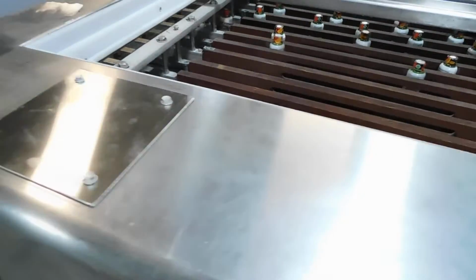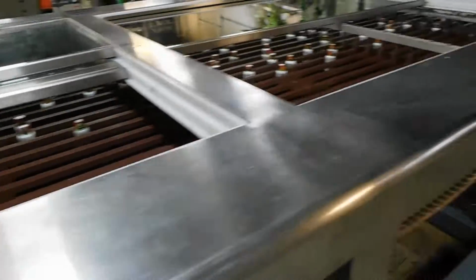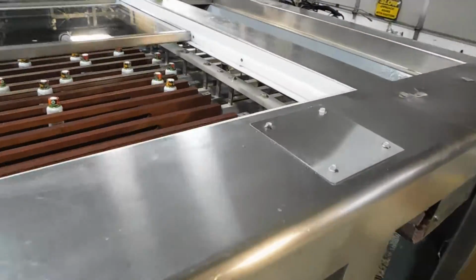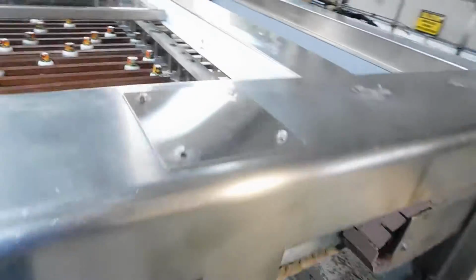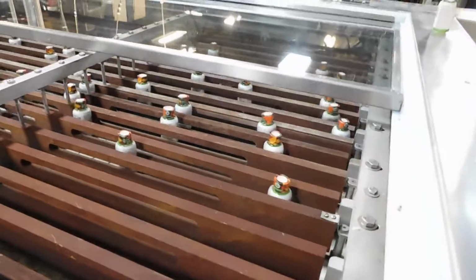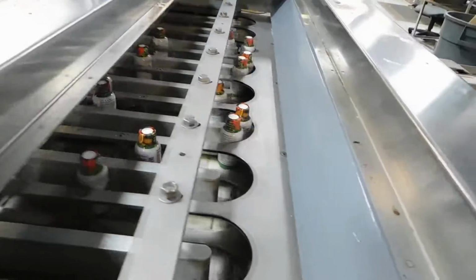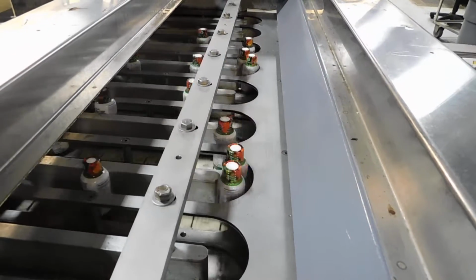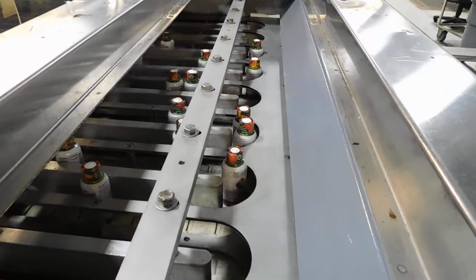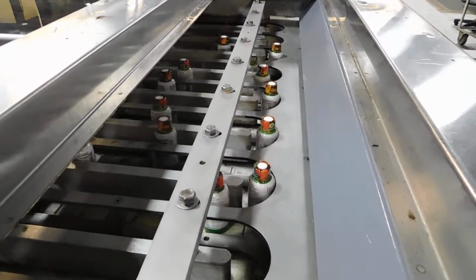And by the way, a couple notes here. Those were the pockets we talked about for mounting your new equipment. We've taken them out and put a nice cover plate over it so you can still access it. You'd be inside of that tube right there, which is 3x3 structural steel square tubing. So we can buy a 2.5 by 2.5 square tubing, which should fit in there pretty easily, and from there you can go right up and build your frame. We'll talk about that shortly, but I wanted to give you a good look at this.